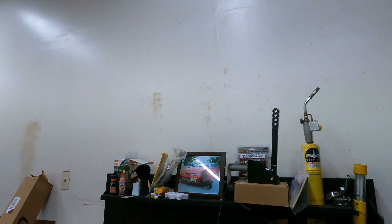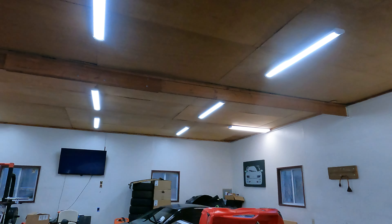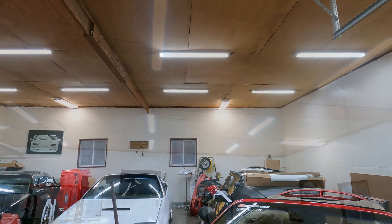The contractor is going to box in the beam and sheetrock the whole ceiling. I also need to remove the old tape from the drywall on the walls — you can see how some of them are splitting, the tape is coming up, and there are cracks all the way around. My guy is going to come in, rip all the tape out, retape everything, drywall the ceiling, frame out and box in the beam, and re-install the lights.